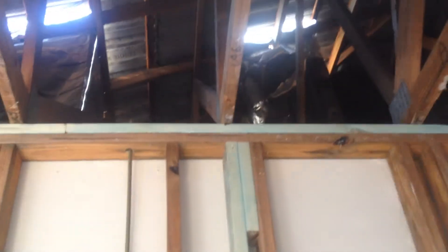So we virtually had to rebuild the place. Have a look under these trusses — they're actually off plumb by probably 70-odd mil, and this one's probably more. You can see the big twisting. We're going to adjust these roof trusses a bit more. But have a look at where they're located now — underneath each truss there's a new concentration of stud work that comes right down. It's supported. And same here, there's another double stud that's supported now. So they've actually got supports under each truss, which takes all the roof load.